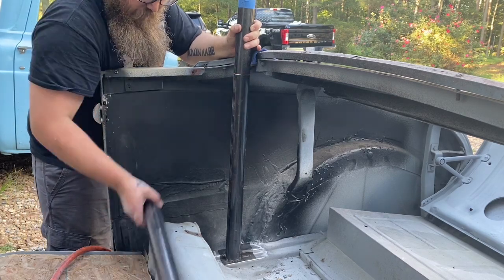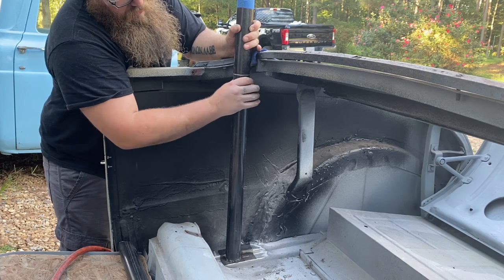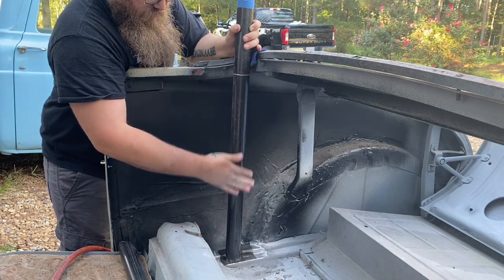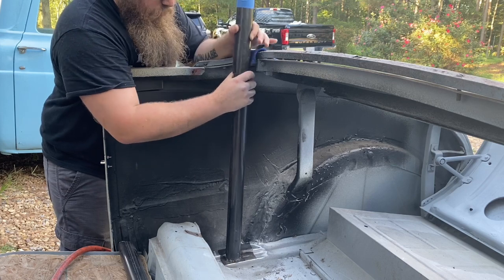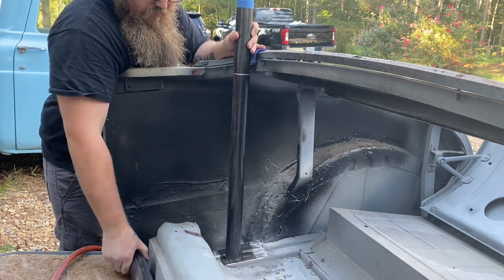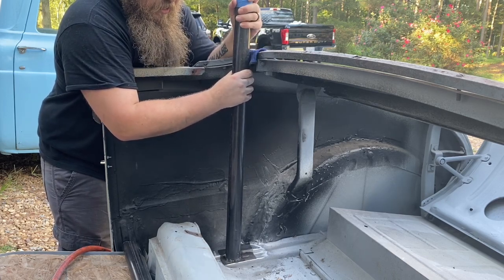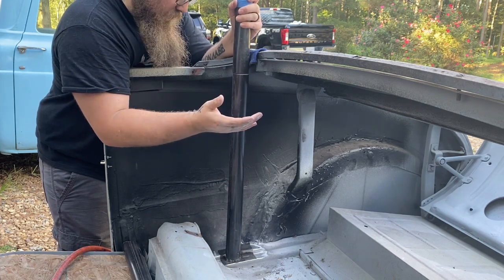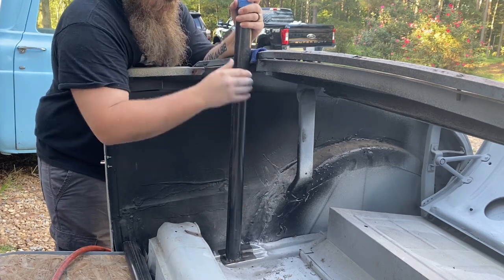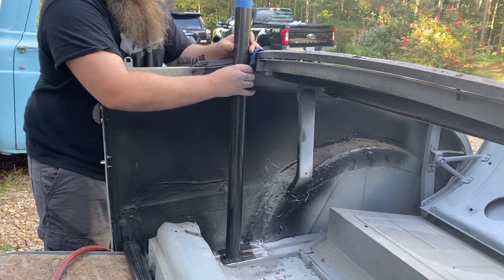I have my crossbar ready to go in here. And I can reach that because it's going to be right here. It's going to be just below this line. So I'll be able to reach that all the way around with my welder. So what I want to make sure is that these angles are exactly how I want them. And right now I have the most control with nothing on it. And if I'm trying to weld my crossbar in without these being stable, I'm gonna be messing with two different things, a bunch of different angles, and I'm gonna be praying that I don't miss something in that whole process. So I get both of these individually sturdy where they need to be, then I'll put the crossbar in. And I'm not 100% sure that the length and fit of the crossbar is perfect yet, so I even still have to work that.